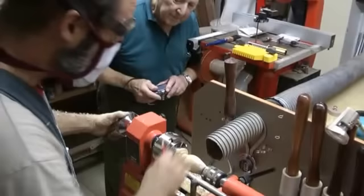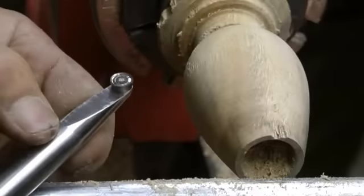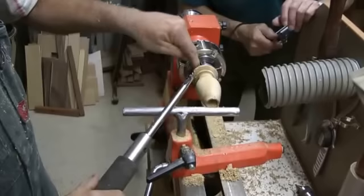Now what I'm going to do, I'll go in and I'll start hollowing this out. My favourite hollowing tool is a little tungsten carbide 8mm cutter, and it's made by Vermec in Queensland. It's a specialist tool and it's a beautiful cutting edge. You always need to cut on the centre line, as close to the centre line as possible, and you can rotate it if and when it gets blunt. It's a homemade tool, and all I've done is sharpen the edge, just so I've got a nice sharp edge, but I can get it smooth right across the bottom. We'll try it and just see how it goes.